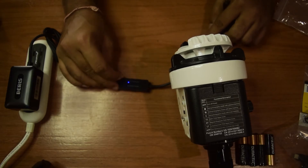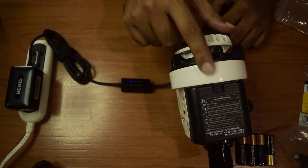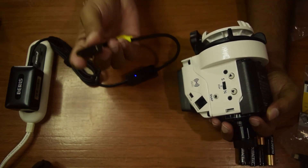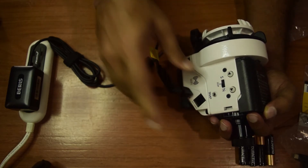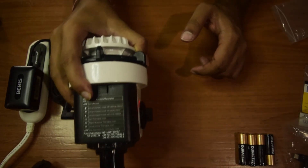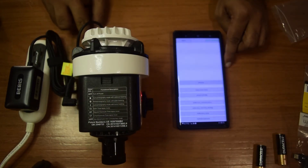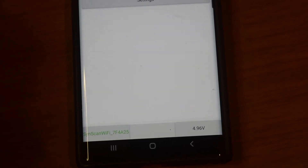As you can see it is currently on the first LED which is 5 volt. I'll connect this 5 volt to the Star Adventurer's mini USB input and turn it on to app mode. As you can see on the mobile app, at 5 volt on this power adapter it shows a voltage of 4.93 volts — so it is undervoltaged compared to the battery and quick-charging methods.